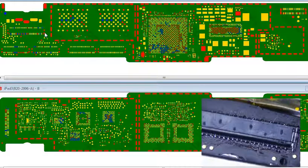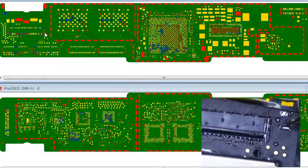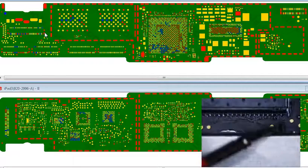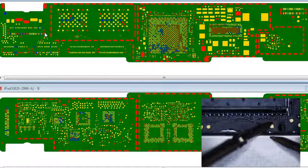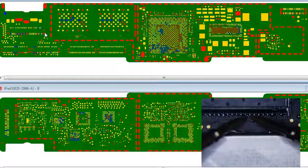And then you can also check for your grounded tab. So let's see, like this one. Let's take a look. So this is ground, I believe. So this one should be ground. Okay. And then 6, 2, 6. Okay, those are all good. So now I'll go to this side, do the same thing. So these two should not be beeping. So there's a bridge. So that needs to be fixed.